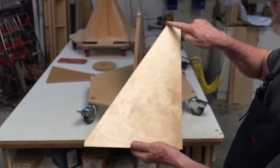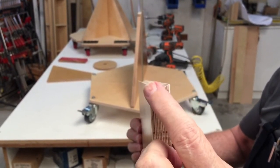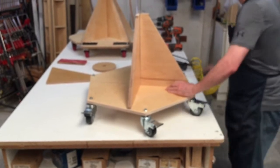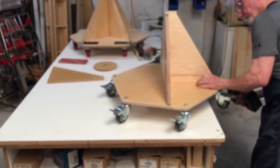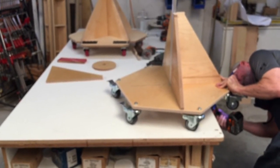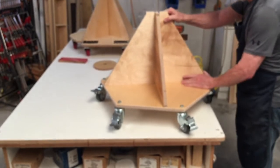Now here you see the shape of this. This is done with CNC but you don't need to exactly shape it like that — it does need to be a 90-degree angle. The important thing is that you have some sort of indention here that will work as a shoulder against that pipe. That happened to be a one-inch flute cutter that I had — put it on the shaper and ran all these things, it worked out perfect. You can do it with a dado blade, a V-groove blade, a router bit, or even a saw. You just need a shoulder for the pipe or tubing to rest against to keep it from moving side to side.